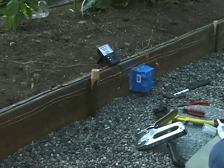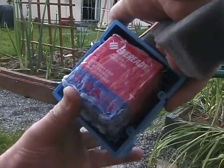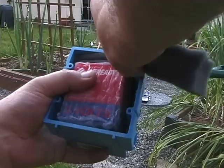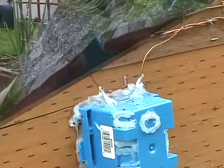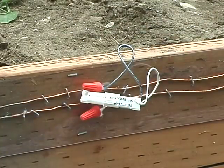Finished — one more box down. This is for those who want to go through the school of hard knocks and waste batteries: do not put silicone on the battery leads because silicone is conductive and it will pass the charge through the material, glue the leads, and it will short out. Make sure the negative and positive terminals are not touching anywhere, and make sure that none of the staples are contaminating your line.